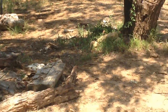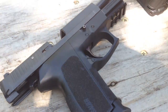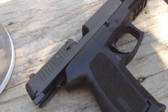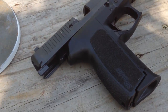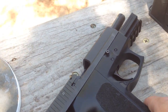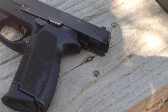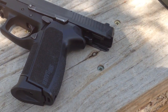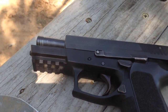The real reason for this video is a review and update on the Sig Sauer SP2022, which had some problems. The Sig's a great gun — been out since around 2010 or 2011, and I acquired mine in mid-2012. After shooting it quite often, it developed a problem: it kind of went double-action only. When you'd fire the first round and the slide retracted, the hammer would not stay cocked — it would follow the slide back down.